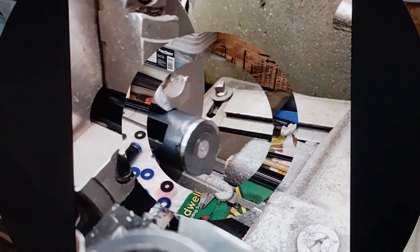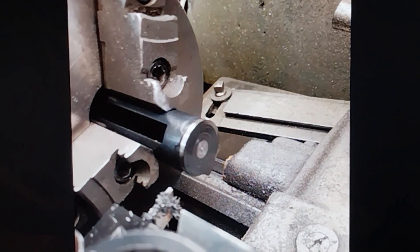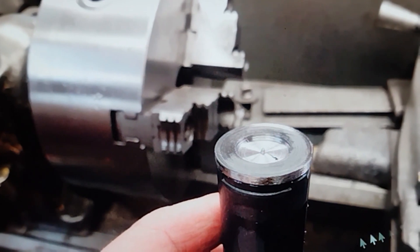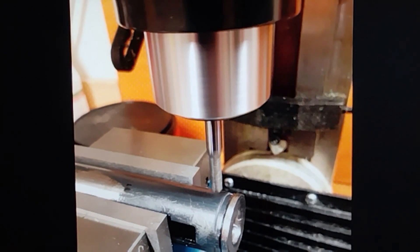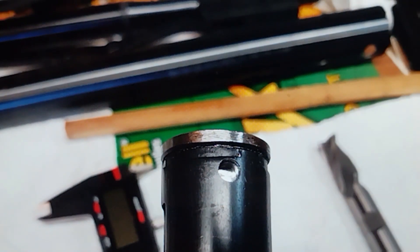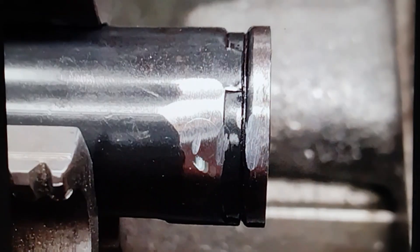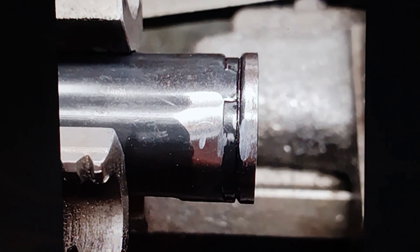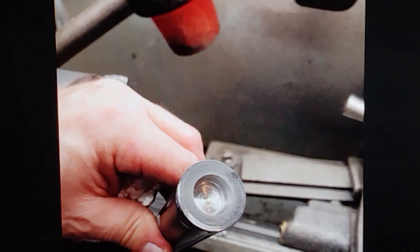Here's the picture show: the piston inside the lathe where we machined the piston button off. Then we start to drill our piston out, but the remaining piece started to move a little bit, so we had to drill and pin it to keep it from moving. Now we're into the mill machine drilling it out. We got our hole drilled — she's back in the lathe, you can see traces of the pin we used. We can now finish boring and drilling it out, and there we are with our hole.